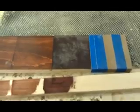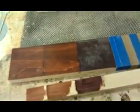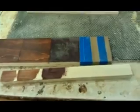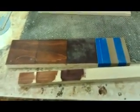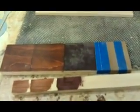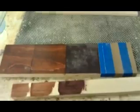The only thing I could understand that really happened here is, number one, the Sherwin-Williams Sherwood BAC or Blend-A-Color stains, the commercial stains that are readily available behind the counter in the stores, use the same colorants that they use in latex paints. So I'm assuming the stain is probably oil modified, because they have a fairly high flash point. I want to say it's a flash point of 100 degrees compared to anywhere from 20 to 40 degrees for a traditional solvent-based stain.